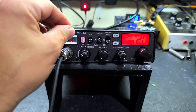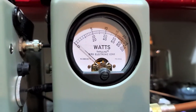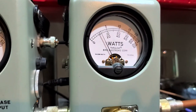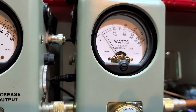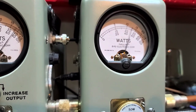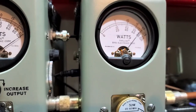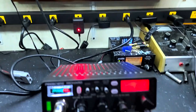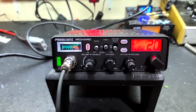A lot of hype over FM right now, so we're going to switch over to FM. All the way down, 50 watt slug. See what we got there? You're looking around 3 watts. 40 all the way up. I recommend running this one around 25 watts or so on FM. Obviously, if you're going to be running it into an amplifier, you'll run it much less.